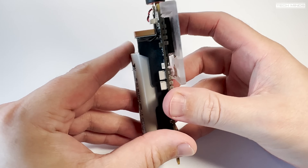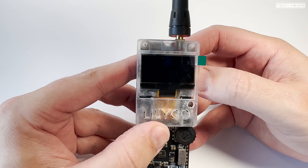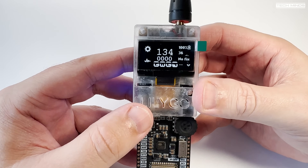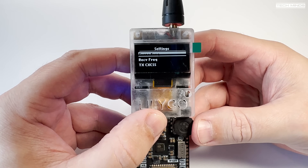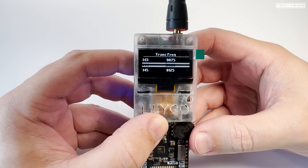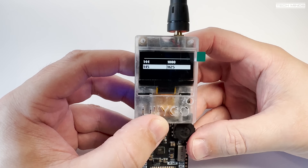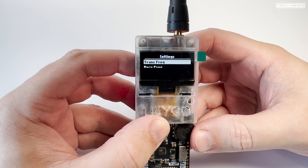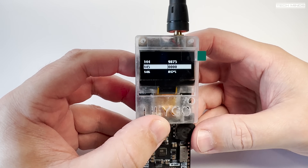Although if you want to play around with the SA868 firmware, I'd suggest you get the Open Edition version. There's also an onboard speaker and microphone, which suggests this could be used as a walkie-talkie — and you're right, this device actually ships with the walkie-talkie demo firmware. The settings available within the firmware can be changed using the rotary control, and these include TX and RX frequency, bandwidth, CTCSS tones, and even squelch. The demo is fully working, so talking through another radio you can hear voice coming from the onboard speaker and transmitting from the TWR+.